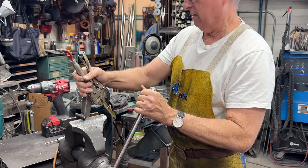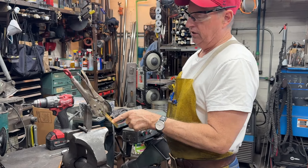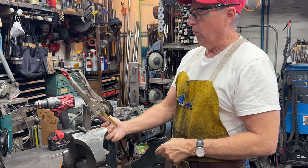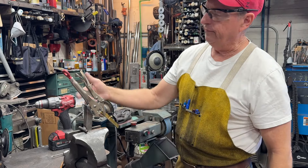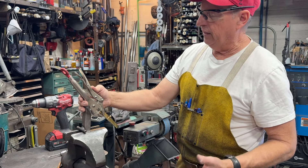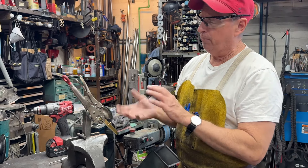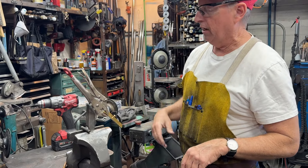That's about right, that's where I want it. So now I'm just going to drill and tap a hole here, flip it over, weld it, and then grind it, just to kind of show the versatility of this little modification to the vice grip. I find that it's incredibly useful for small parts that you have to hold at an awkward angle to drill, tap, or grind.